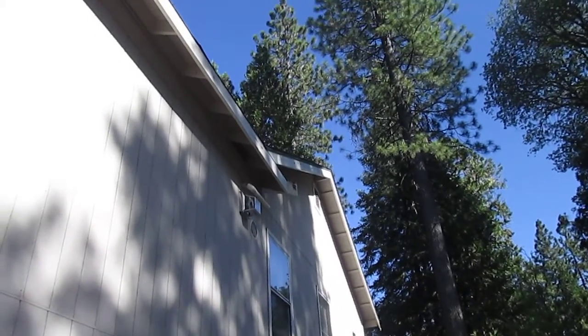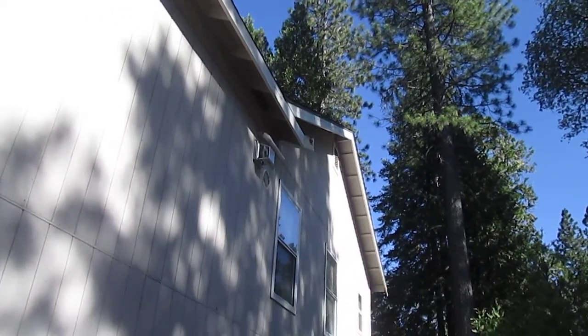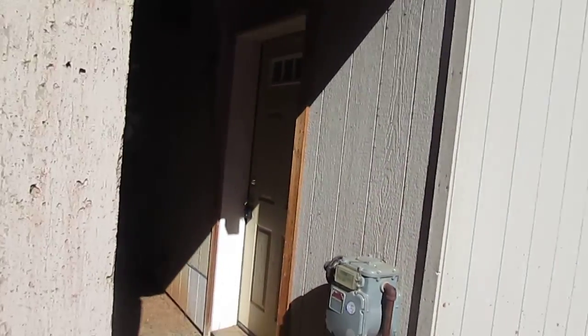So yeah, a lot of woodwork repair up in them corners on all of them. I'm not sure why the carpenters built that out like that. That makes no sense to me, but not a big deal. Standard paint job, nothing too crazy for us. This door would obviously be painted as well. Bare wood, primed, all the butt joints caulked. This wall right here is probably all that we do under here.